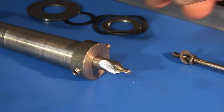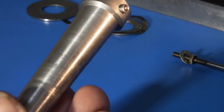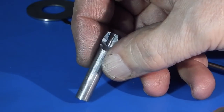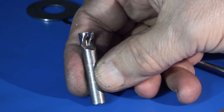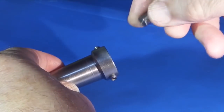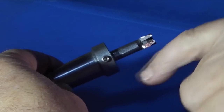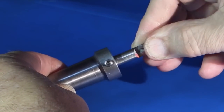This is what we've made. This is the centre drill holder - I'm taking the centre drill out. This is the part we've just made which has a flat along the shaft, machined with the milling cutter. Inside the bore I'm putting a small spring and then the new centre we've just made, lining it up so that the flat is up to the grub screw, then just pushing that in and tightening the grub screw up slightly so it stops it rotating.